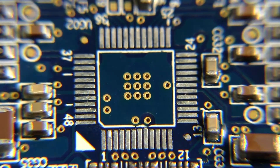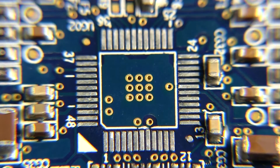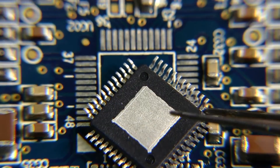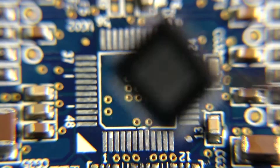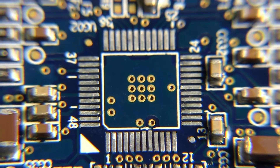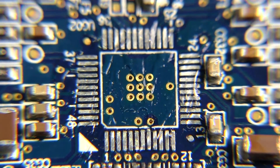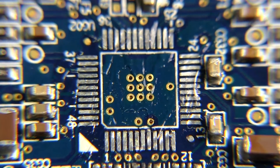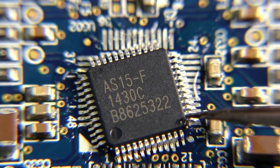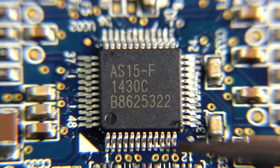One thing I just noticed: this is the original chip — you can see it has a solid back on the bottom side. Here's the new one — this one has a bare metal back. This chip must put out quite a bit of heat, especially since they've got that thermal material up top to transfer heat to the rest of the case. I'm going to add a little fresh flux to the pads and make sure I have the right orientation on the IC — the dot is on the lower left-hand corner.